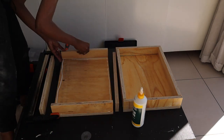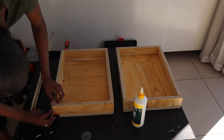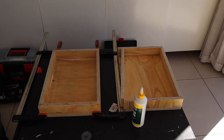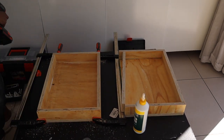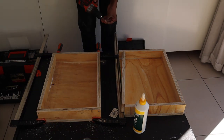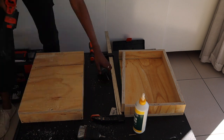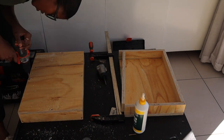To make the drawers, I got these pieces cut and held them together with glue and clamps, drilled in pilot holes, and attached them with chipboard screws. After removing the clamps I flipped them over and drilled in pilot holes to attach the bottom part of the drawer into the sides of the drawer.